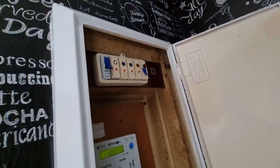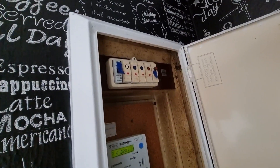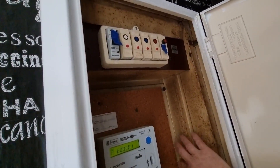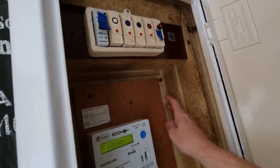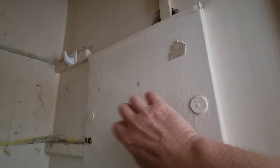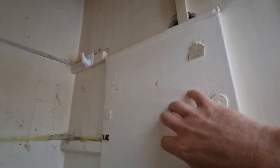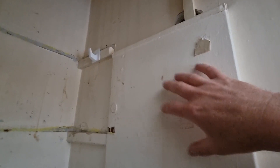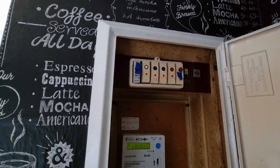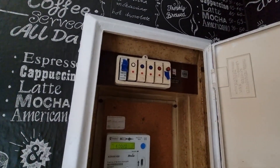What I've also found is that normally these boards would sit on an external wall, so behind this would effectively be another wall, with all of this sitting inside the cavity, and the board would normally sit against the external wall so I can fix to it. But here it's in a cupboard, so I've literally got just the thickness of this. If I need to fix to the back of the board it's going to cause me issues — that's why I'm hoping I can fix to the sides, which takes that issue away. I can drill into this, but I won't know until I start working on it. So I suppose the next thing is just to crack on and get this show on the road.